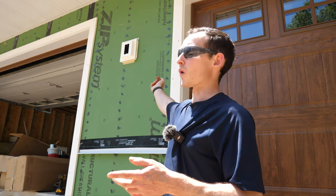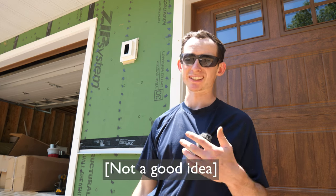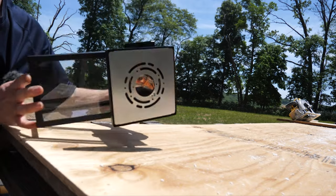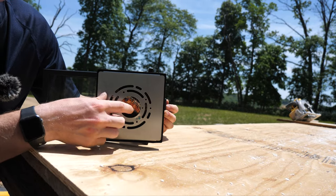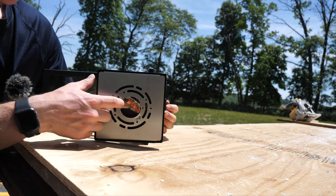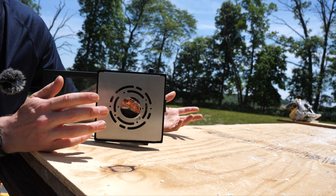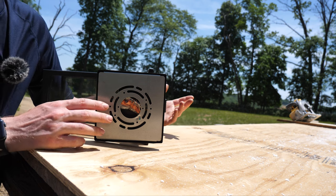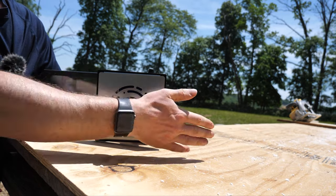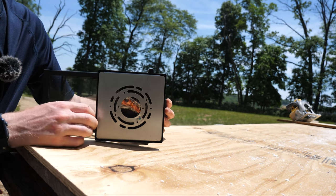What I've seen on other build sites is just wires hanging out of the wall — they drill a hole, put the wire out, and use the fixture as its own junction box. After doing a little more research and asking around, I learned this is not an NEC acceptable practice. Every fixture needs a junction box of some sort. In just a bit I'll go through how I was able to accommodate an actual junction box at these garage light fixtures.